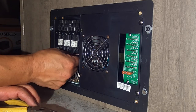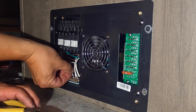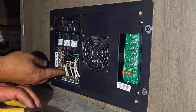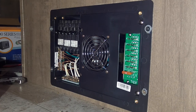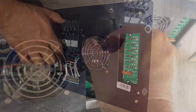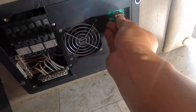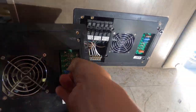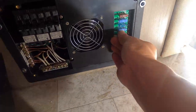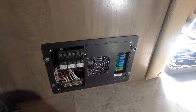Note that all white wires are firmly connected to the neutral bar, and all ground wires are firmly connected to the grounding bar. The last step before restoring power to the trailer is to replace each fuse by removing them from the old power center and placing them in the corresponding location in the new power center. The new power center comes with a 40-amp fuse already populated in the correct slot, so you get a spare 40-amp fuse out of the deal.